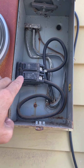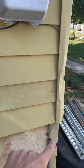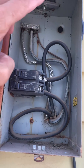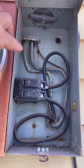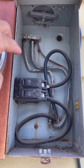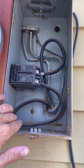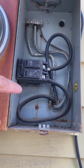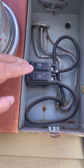The system here goes to earth — that's going to be your grounding electrode conductor. That's going to be your grounded conductor, or your neutral. Over here is your equipment grounding conductor, also part of your grounding electrode conducting system. And then you have your ungrounded conductors here that go into this overcurrent protection device. Again, that's going to be found in 240 and 250.